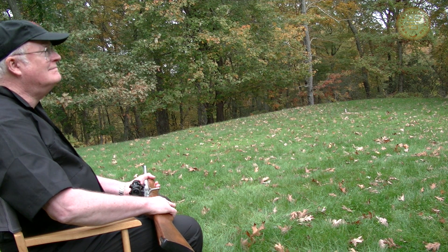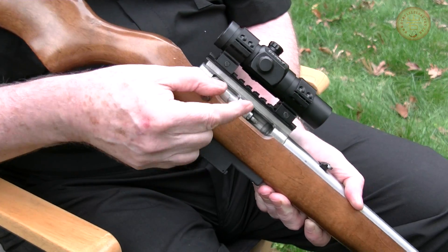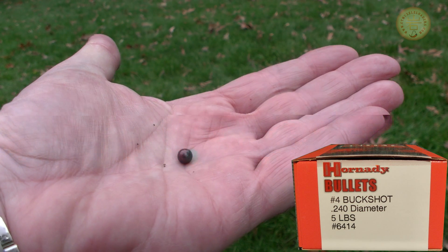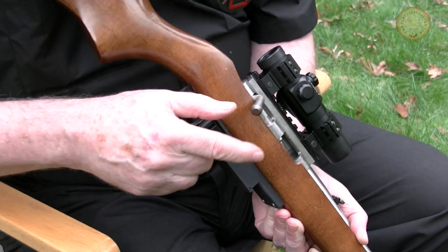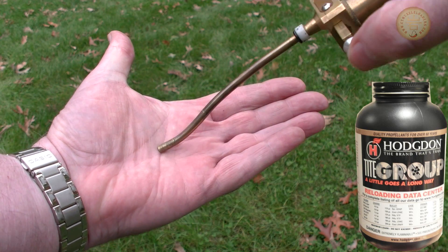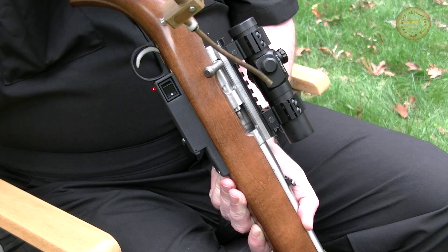Besides the time and distance, the other change is it's not anything like my old .22. Instead of using traditional cased ammunition, it dispenses with the case and just loads the basic components themselves. This is a single pellet of No. 4 buckshot, which measures slightly larger than .22 caliber. The chamber of the rifle is designed to automatically swage it into a .22 caliber slug as it is fired. The propellant is a small charge of smokeless or other powder, added separately to the firing chamber behind the ball.